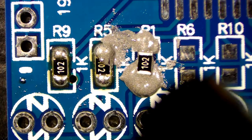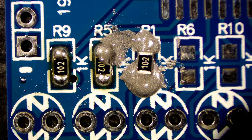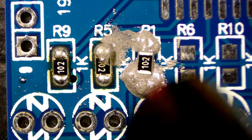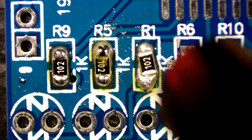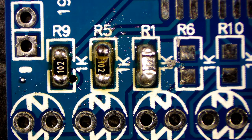I'm heating this up now — you'll see what I mean in a second. Even though I was recording, I hadn't turned the blower up, so there was no hot air coming out. I then realised my mistake — turned up the blower, and if you just give it a few seconds, it's like the Terminator effect. It just rolls into place and sets everything how it should be. The surface tension pulls the resistor to where it should be. And there we go. I did test afterwards to make sure there were no continuity issues — I used a meter for that.